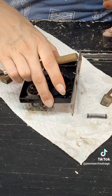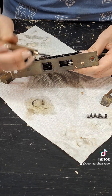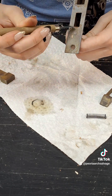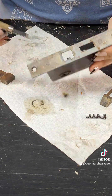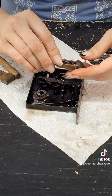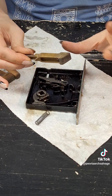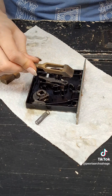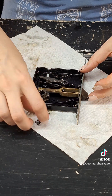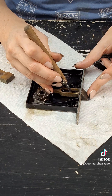The next thing is to take your flathead screwdriver or a wood pick and remove any paint along the inside edges. Then reinsert your lock tab. Here's a good tip you may not know: most mortise locks, except for exterior ones, are reversible. So if you buy one that's not the right swing direction for your door, you back it out, flip it, and insert it — so if you think you picked up the wrong thing at the store, you're probably still okay. Put that spring back in; if your lock doesn't have a spring, that's okay, a lot of them do not.